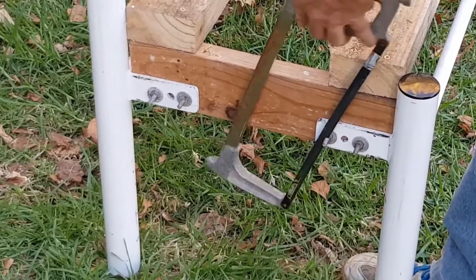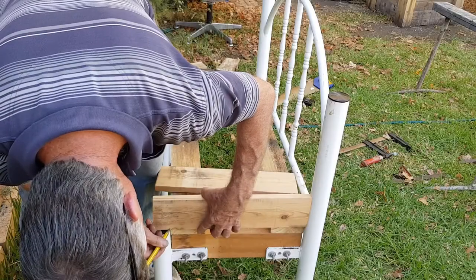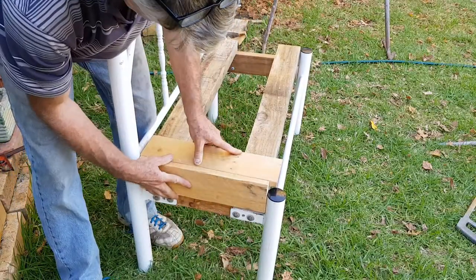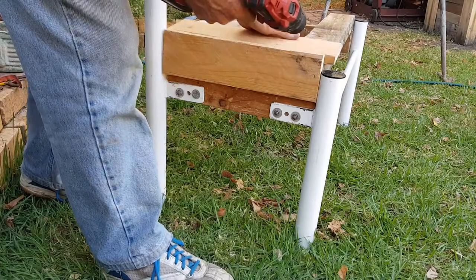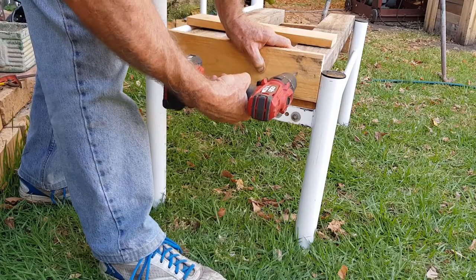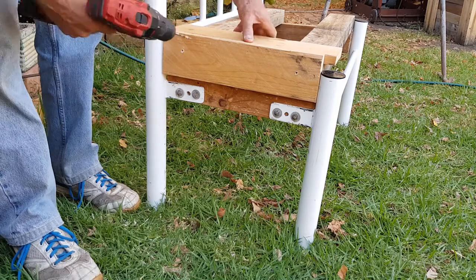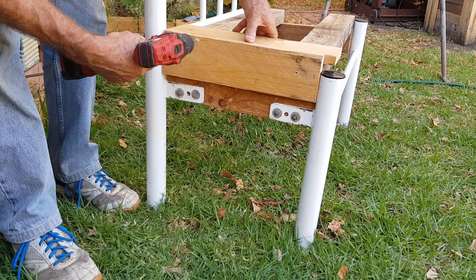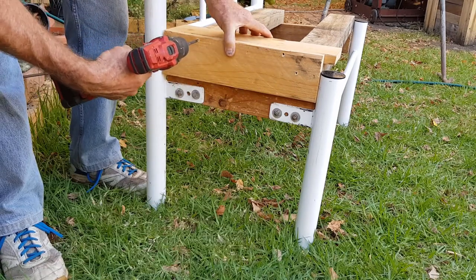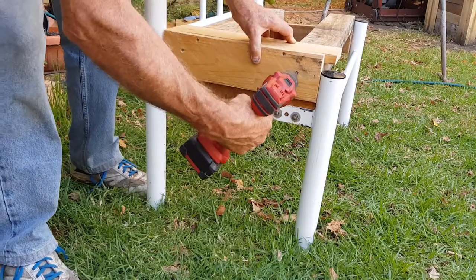There's not a lot left to do — I'll just trim the ends of the bolts off with a hacksaw so they're neat, and file off any burrs or sharp bits that can cut your fingers. I'm making a couple of end plates here just to tidy it up. It's not necessary, but it puts a cover over the end of the rails, keeps the weather off them, and gives a good end for the seat planks to butt up against. I'm pre-drilling these — it just makes it a lot easier to pull the board up tight, without any danger of splitting.